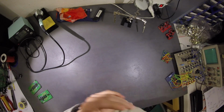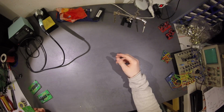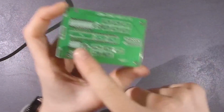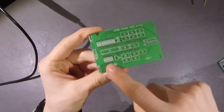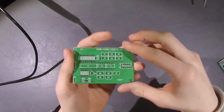This was my second design, and then I thought, there are so many, let's get a PCB, because then later I can build some more. So I designed this PCB. I have the schematic right here. Because all the resistors go upwards or downwards, I thought, let's use some resistor banks here and here, the capacitors here, the trimmers here, and a 5-volt regulator. It's a little bit complicated with the traces, but I thought this looks nice.